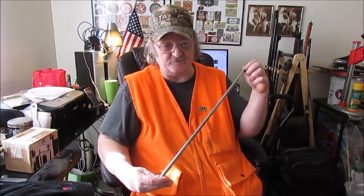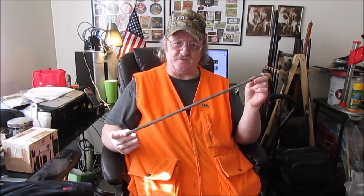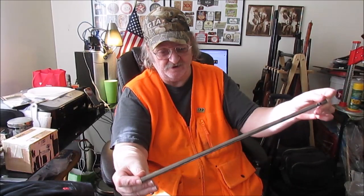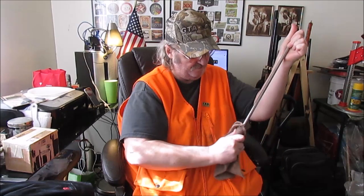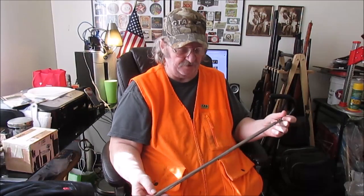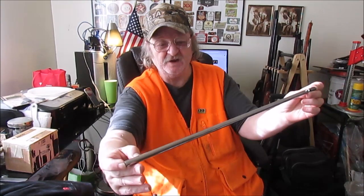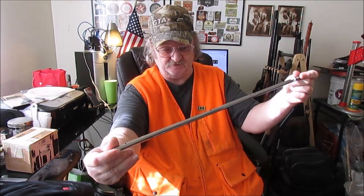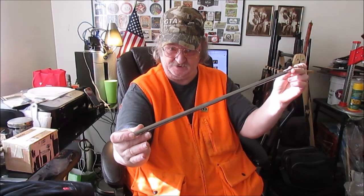I used that and polished it the same way you saw in the black powder shooter videos restoring the rifle when I was polishing the brass. You can see how shiny that is. It still needs the cleaner degreaser because you get that real fine gray powdery metal in the pores. Once you get it cleaned up you should see less of those little micro grooves going around it from too high a tool speed or the cut being a hair too deep.